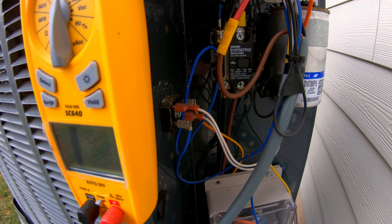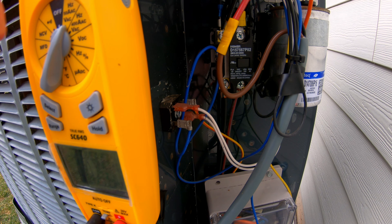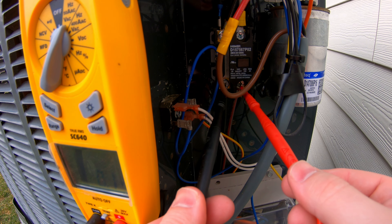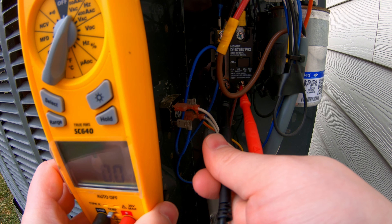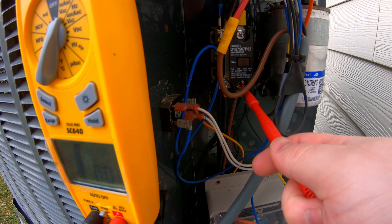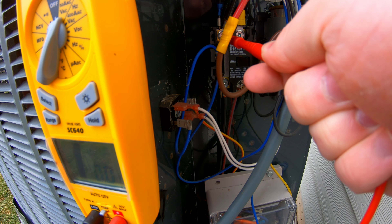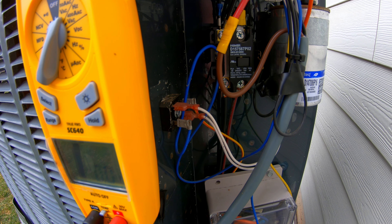So first thing we want to do is just verify that the power is completely turned off. I'm going to come here to my multimeter and set it to one of the volt settings. We're going to come here where the power comes into the contactor and just test there across it. You can see that says zero — it's also not beeping. And then we're going to test it to ground, just find a good grounding surface. Zero on that leg. Zero on that leg. We'll test it at the top as well just to be sure. Zero. Zero. The meter will also beep if there's dangerous voltage, so we're good — we're dead.